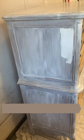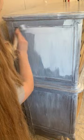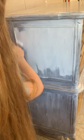For the paint, I chose Benjamin Moore in Simply White. It's a latex paint and it levels extremely well so you get a smooth finish. Once you move on to a new area, resist the urge to go back and smooth out brush strokes. It will look like you need to, but the paint levels so well, if you leave it be, it will smooth out for you.